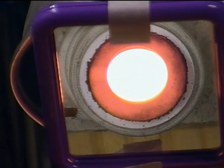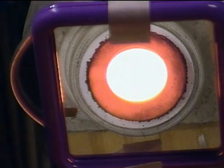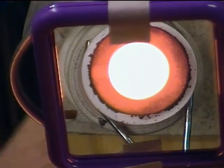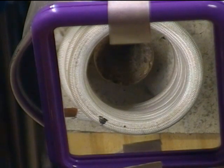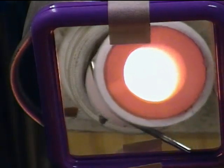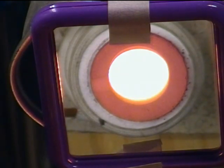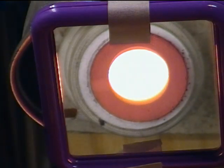I guess we will pour just because we can. You can't see it, of course. Back to 6 amps. Water got up to 39.7°C. Current went back to 38 amps, even with the crucible red hot, by the way. I'm going to turn the power off now — that's the end of the test. 20 minutes for the whole works. 320 grams.